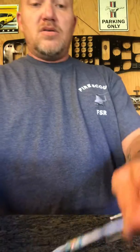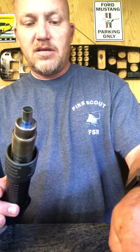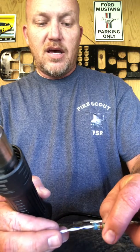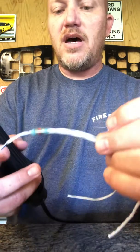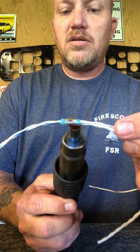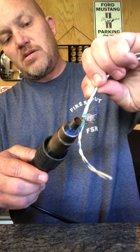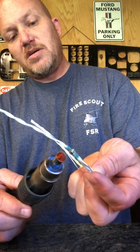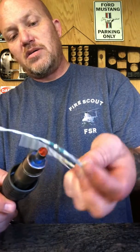This is a good example of a heat gun — it also does solder but I don't have that hooked up right now. This one automatically comes on as soon as you pull it off the stand and goes right to the temperature I have it set at. I have it set on high — I think like 480. What you'll do is slowly heat this down and shrink this down. You'll notice the red band is gonna disappear and then the silver inside will spread out.